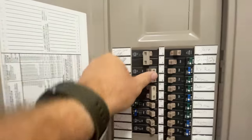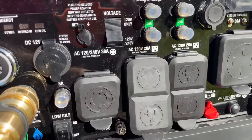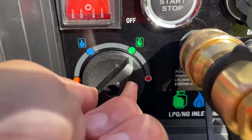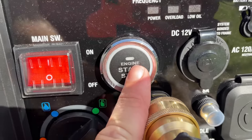I'm not actually powering my whole house — I'm powering my mom's part, which is essentially a separate house with all the appliances including a three-and-a-half ton AC unit. I'm going to cut the AC off before switching off the main breaker and turning the generator on. Breakers are off, low idle is off, switching to propane, main switch on — engine start, let's go.